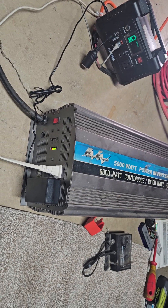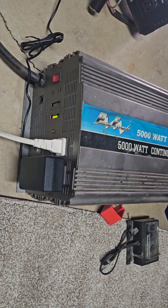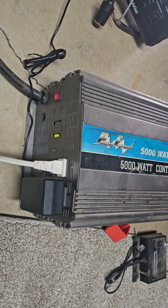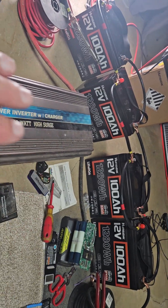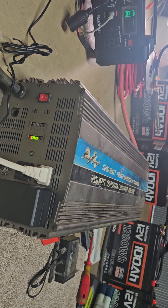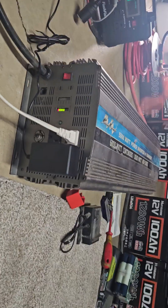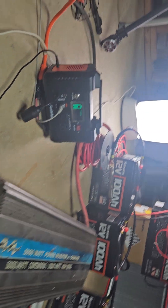So let's see if this is a good test. I got one of those sun lights for wintertime, but it's coming off the power of this inverter because it's plugged in. That's being charged — it's all backup with the batteries. They're not doing anything but being charged right now. Everything's going through the wall: 110 in, 110 out, with no help from the batteries. The only thing the batteries are doing now is being charged. So when I unplug this — everything should instantly stay on, might flicker. Yeah — didn't even do anything. I pulled the plug out, everything stayed on. The light didn't even flicker. That's still charging.